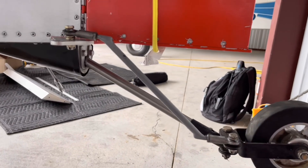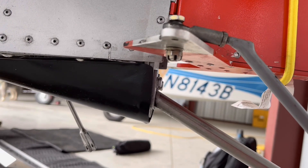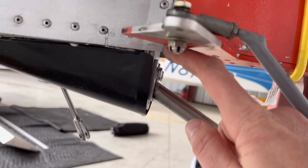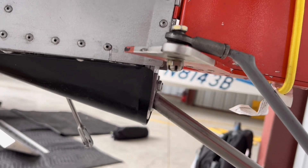This is the way we found it with the control rod fitted on top. The thing we were concerned about was the measurement between the control horn and the fuselage. These are supposed to be at the same level, but in fact the control horn is a little higher. So we'll have to set the new rudder back to the appropriate level.